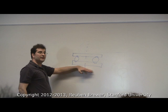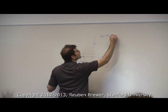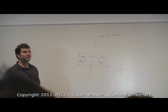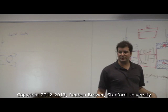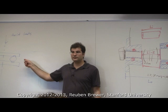And basically, these are designed for axial loads. This is the way you do huge axial loads. So if I wanted a turntable robot that I would sit on and it would just spin me around, and if I did that with skate bearings or that type of bearing, it would break the bearings. Would it break this? No, this is just simple rolling, right?